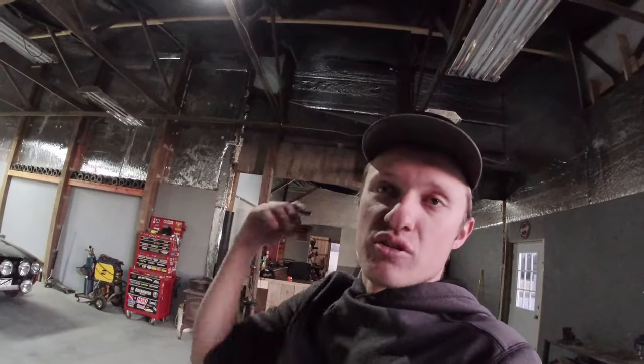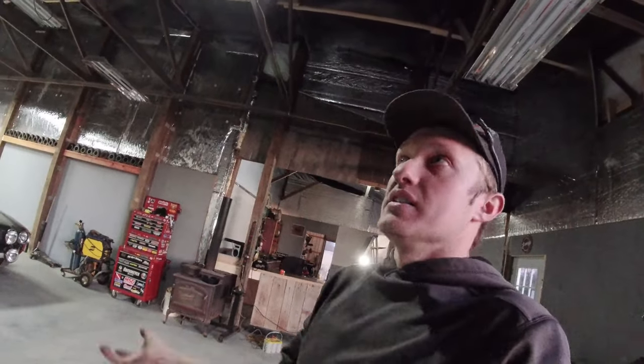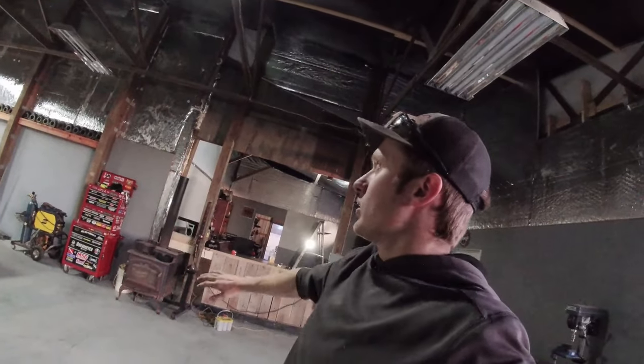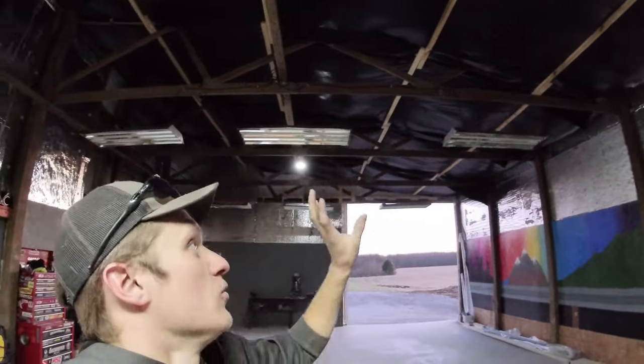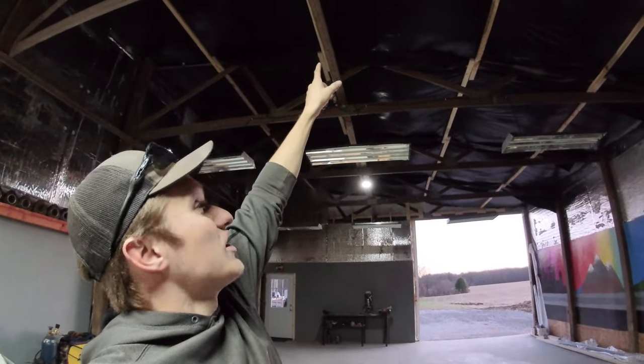I wanted to use that in the roof because the most important part when insulating a building is that all your heat goes up. I have a wood stove to heat this place and heat is going to want to go out the roof — the thicker the insulation on the roof the better it'll hold heat. The walls have about an R6 value from one and a half to two inches of insulation; the roof has an R20 value with six inches of fiberglass. Getting that fiberglass up there, Calvin came out and helped me — huge having his help. We put up the fresh boards that run lengthways, then snaked the insulation in.